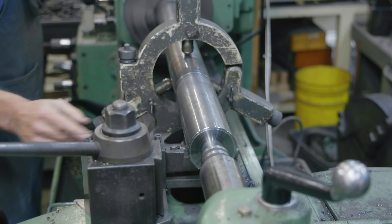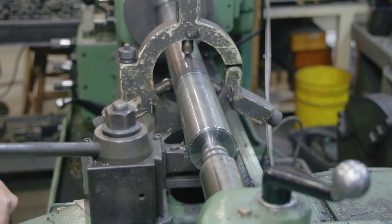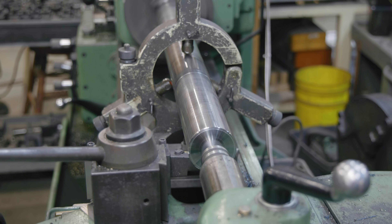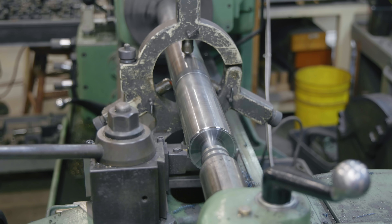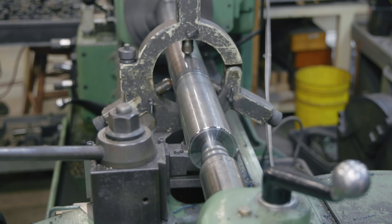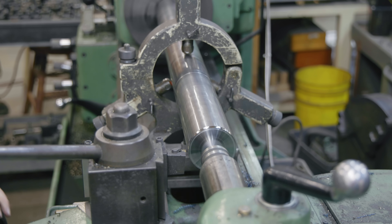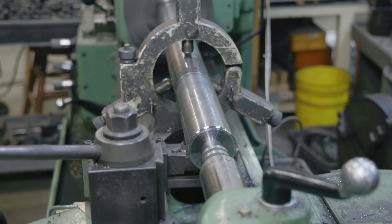We're starting out at three inch diameter. I'm going to take it to 2.560 on this diameter, so I'll come in and touch off and take about a hundred thousandths off the diameter. We're going to have to find an amount that we can turn without getting chatter in it — we may have to make some lighter cuts. This is always a problem when you're running with long shafts; you get a little vibration and harmonic going on.